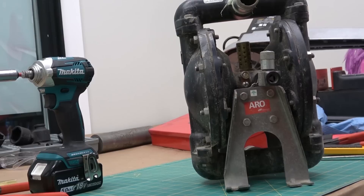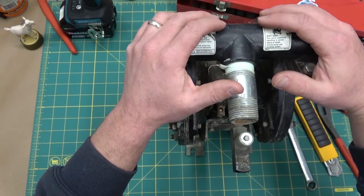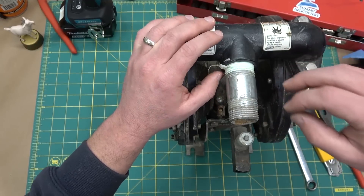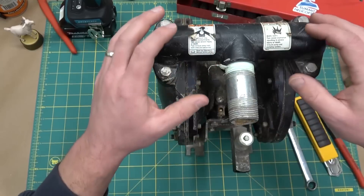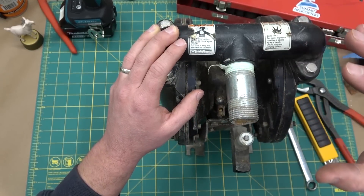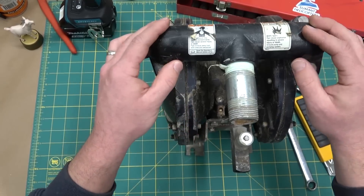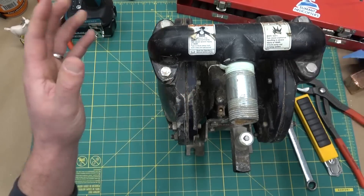A diaphragm pump. Industrial in stature, skookum in chucker. Diaphragm pumps are extremely robust, used throughout industry to move fluids and solids in slurries — stuff that's unexpected. This will move wet sand with one-eighth inch ball bearings in it all day, every day. Extremely robust. Now, because they're used in such extreme environments, they wear out constantly. They're constantly blowing diaphragms, and on occasion a chunk of schmoo gets in there that can't get past the check valve. You open it up, clean it out — nothing wrong with it. Something falls out and then it works again.